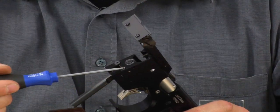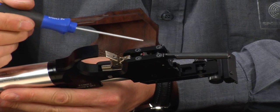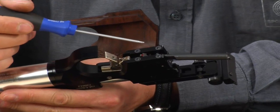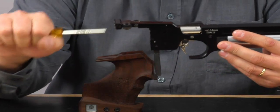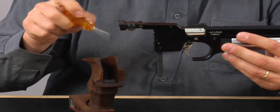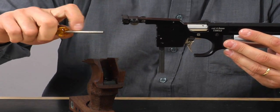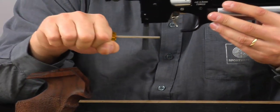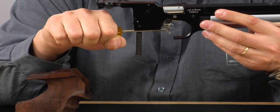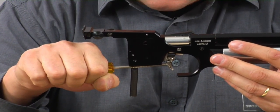At the rear of the housing, there are two 2mm countersunk screws, and on the underside, there are four of these screws. By turning these screws, you can achieve different angles for the grip. Here you see a demonstration of these different angles through using the metal shaft of the screwdriver. If the grip is mounted without any adjustment of the underside screws, the pistol is straight.